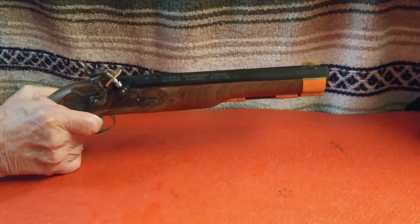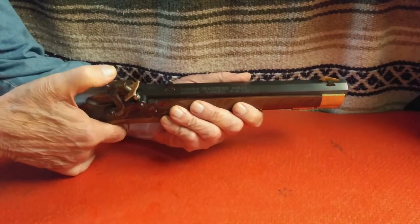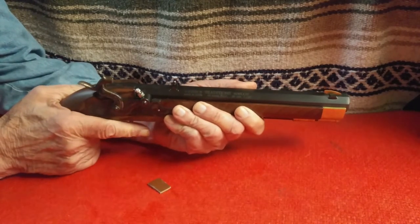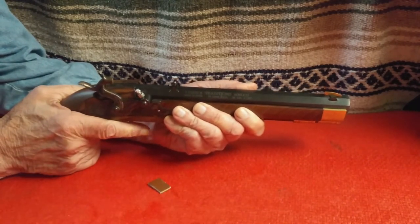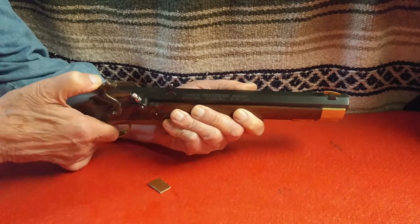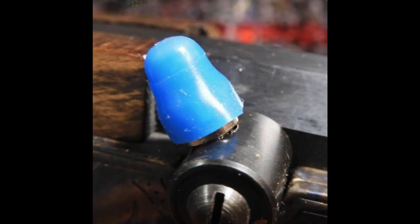I would imagine that carrying a pistol with a safety might also have been practiced to prevent unintentional discharges. However, it does take some force to ignite a percussion cap, and simply resting the hammer on a percussion cap may have been the way of the day. The trick is to have a buffer between the hammer and the cone, and modern vacuum caps are but one way, and vacuum caps can be found in various sizes and thicknesses.